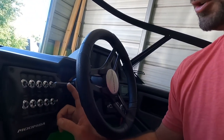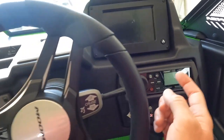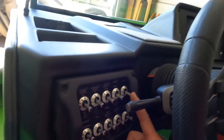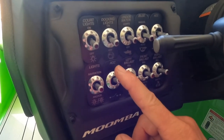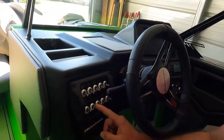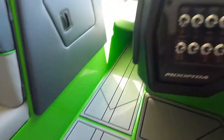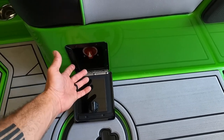What I did was pull the 12 volt power from the back of this Fusion unit from inside and wire it to this accessory switch. Originally this accessory switch would be used if you have the option of the RGB LED lights, so you won't be able to use it. There's another accessory switch here that is on when it's up and on when it's down, but if your boat's equipped with the factory heater, that's where that switch is going to be used, so you may have to come up with your own version. Or just physically wire your radio directly to battery power and just have to physically turn it off. Or, since these have convenient battery switches now, when the battery switch is turned off, it'll kill power to the radio. Otherwise, it'll be powered all day long.